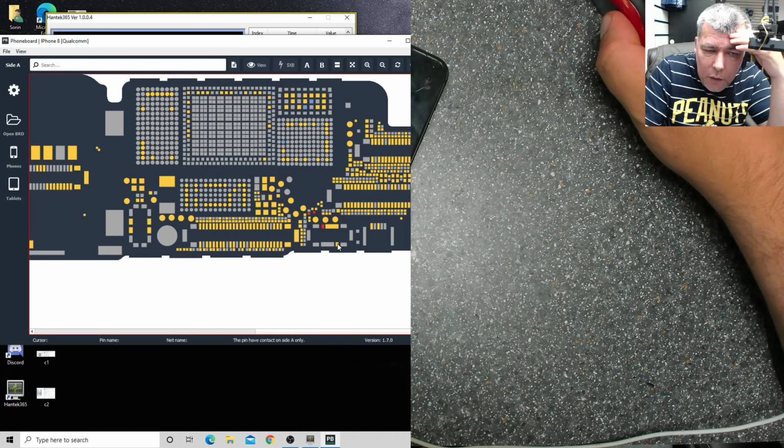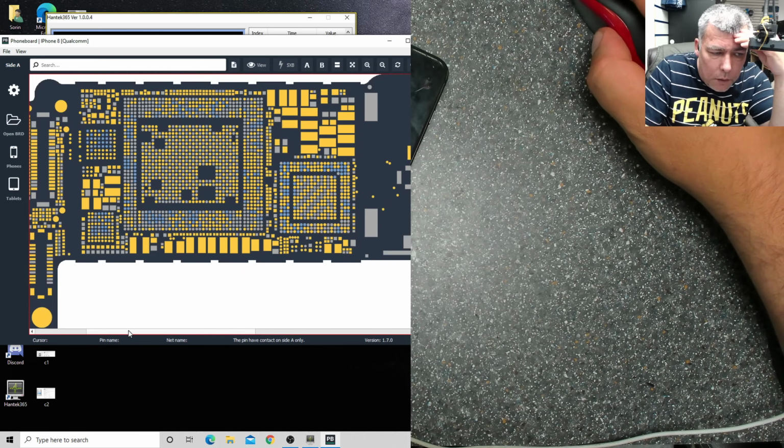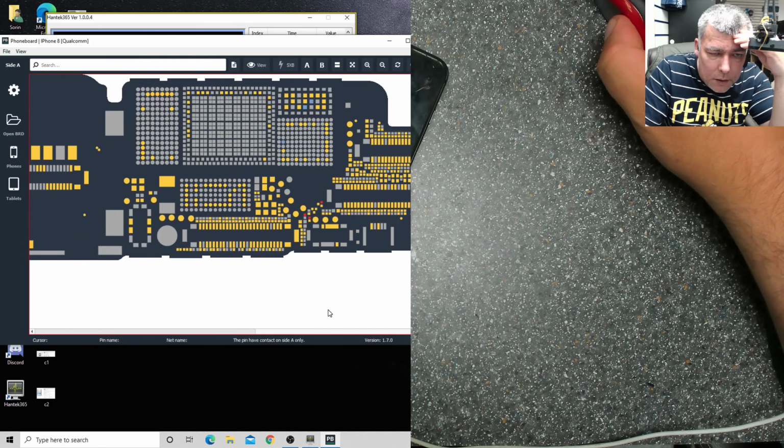You have one clock and one data line here. I don't know which one it is. So as you can see, let's take this one. Here you have, I think, some transistors, so probably some MOSFETs. Three here. If I connect the other data pin, we have three here. This most likely is a capacitor, we don't care about that. We care about this transistor. Let's see where the signal is going. You have to see the big picture to understand how this works. We have one pin there, one pin here.